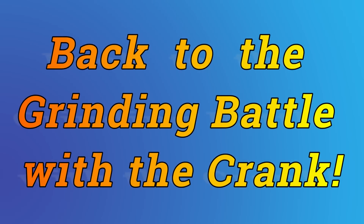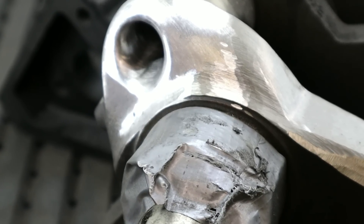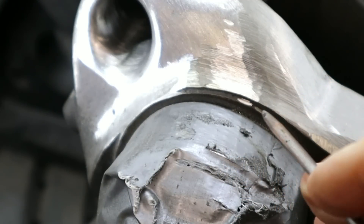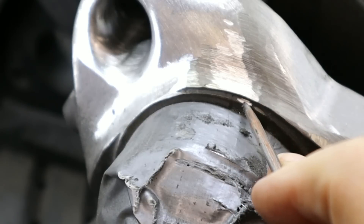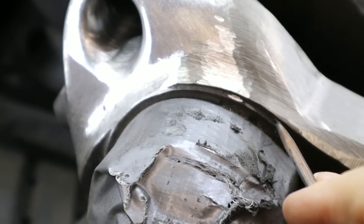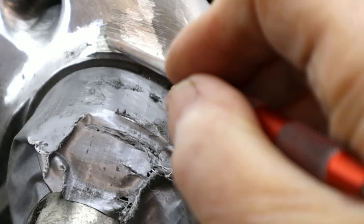Now what I'm going to do is move on to the crankshaft and show you some more lightening on the crankshaft. It's a slow process as far as doing videos is concerned, but it's getting done. Uncle Brian, please note — it's getting done. I don't know how easy you can see it, but I'm grinding this piece here to follow this machining line around here. This surface here is machined, and just where that mark is there is as low as I'm going to come with this. I'm going to blend that all the way in into here, then work on this here.